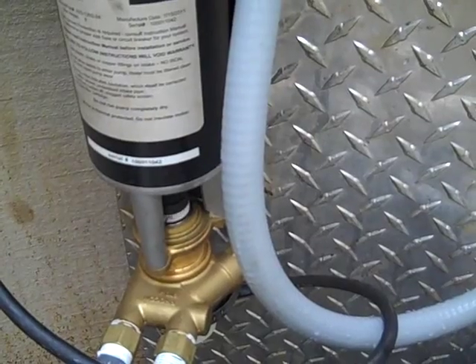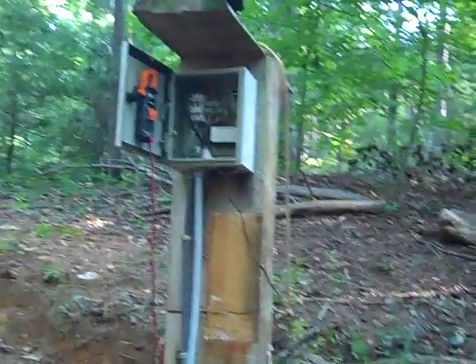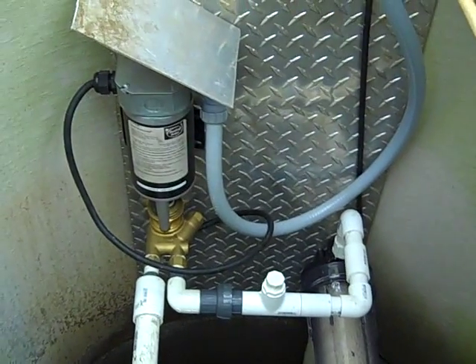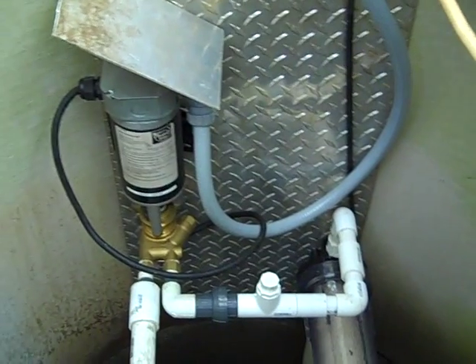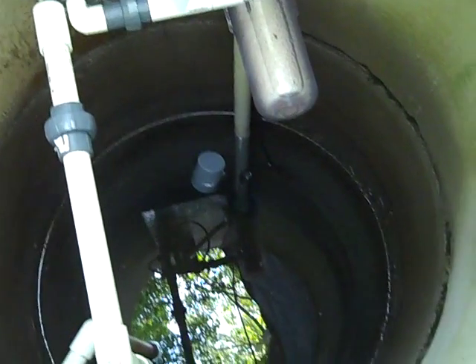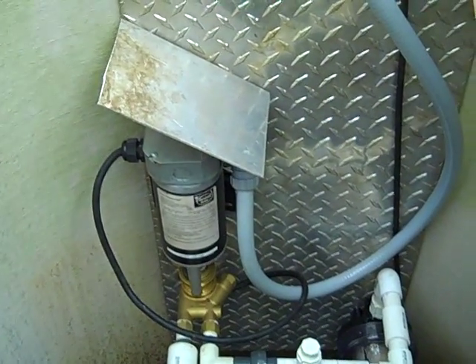That thing's still turning — you can hear it humming away. The water level is dropping, which means I'm pumping water to the tank. It's nine in the morning so it's not at maximum rate, but the linear current booster is converting that low light into enough amperage to turn the motor. I should get five or six hours at 2.2 gallons per minute — roughly 600 gallons of spring water today. If that happens, I am going to do a jig!